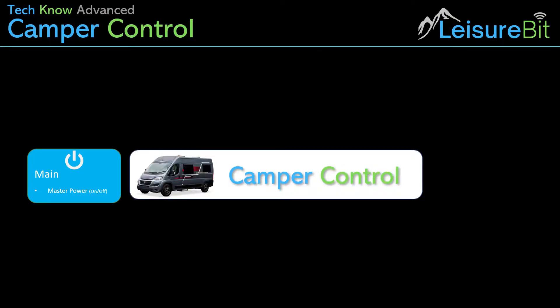So let's have a look at the key features — what I want it to be able to do and the sort of things I want it to control. The first feature is basically the power button, or the main switch, which turns the master power on and off so you can shut everything down. I'm going to put a couple of features on that one — for example, subject to getting it connected up with the heating okay, if the heating has been switched on and you press the master power off, unless you do a long hold on that meaning there's some problem or emergency and you need to cut the power immediately, it will keep the heater power on but turn the heater off for a few minutes, just to make sure it doesn't overheat so the fan blows the residual heat away.